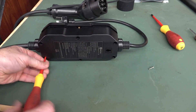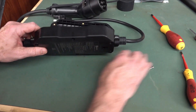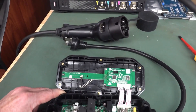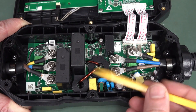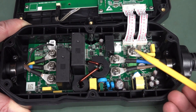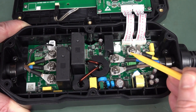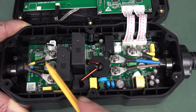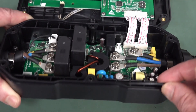Right off the bat here, I'm seeing metal threaded inserts — that's very nice. Oh jeez, that looks nice! Really liking the look of that. Look at those current transformers in there — that's really neat. Loving the crimped connections, and they've got a shake-proof washer on the bottom of those. I love the interface on that. This is really good. It's got an O-ring seal around there for some weatherproofing.